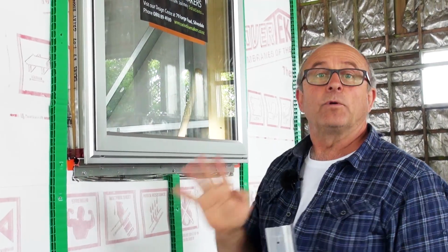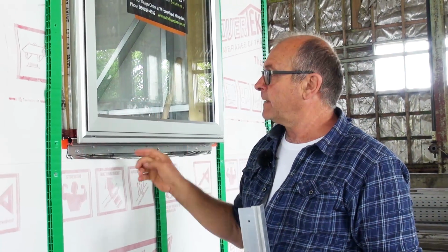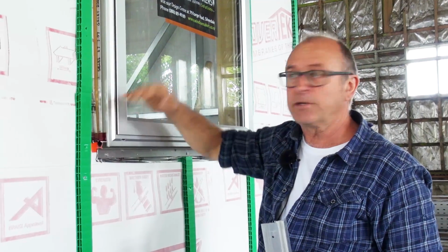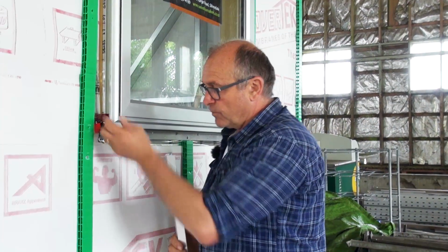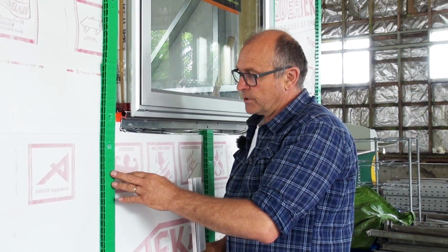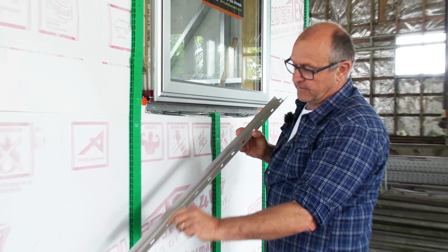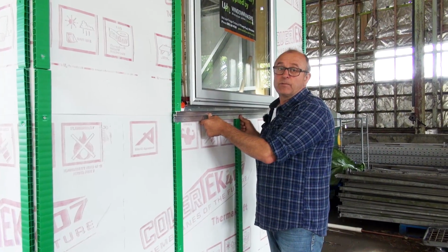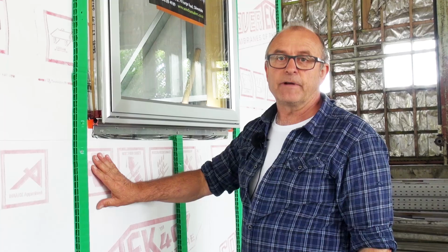We say nowadays that there are 4 Ds important to do with preventing leaks and rotting or rusting. That's simply deflection. That's putting your flashings in properly, your scribers on properly, making sure you're deflecting any weather. Drainage, that's the ability of the water, if it should get in, to drain out, drain through. Drying, which is the ability to have your cavity made properly. So we've got the ability for air to come through here, air to move through our cavity, drying, and then the 4th D is durability, and that's making sure that your framing is the correct sort. In this particular case, of course, we've got steel framing which won't rot.